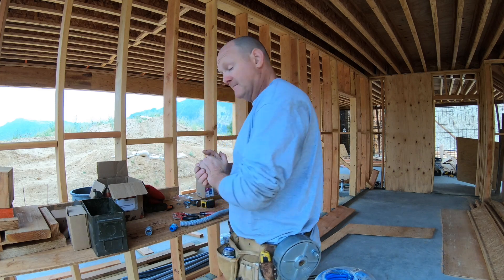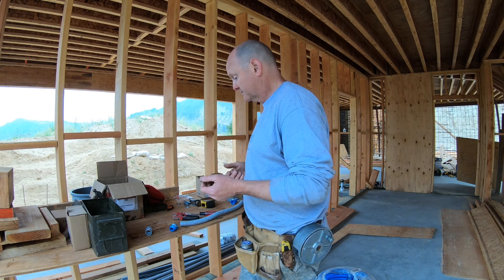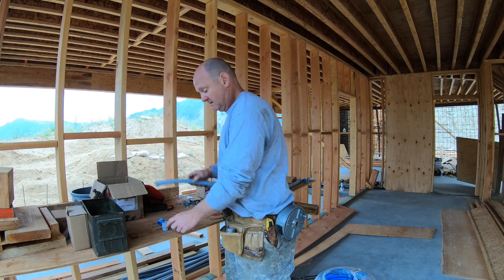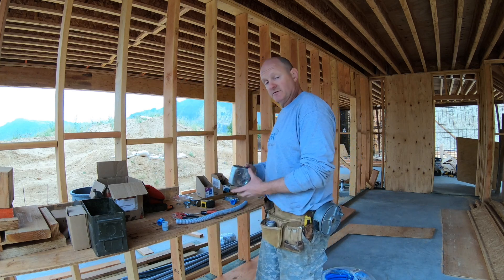Hey, it's Eddie, and welcome to another edition of Stuff and Things. Today we're going to be going over the electrical conduit in the dome. Basically, any electrical outlets that you're going to have inside the exterior walls of the house are going to be embedded in the concrete, so it's really important that you get these situated and done ahead of time. It's actually really easy — you're going to use a handful of different parts, mostly PVC ENT flexible and regular standard electrical boxes.